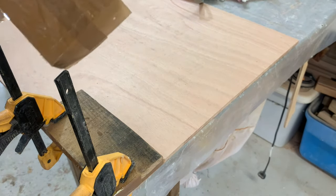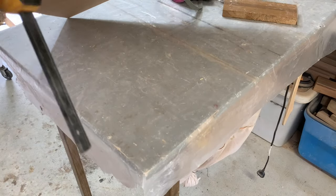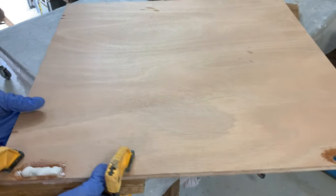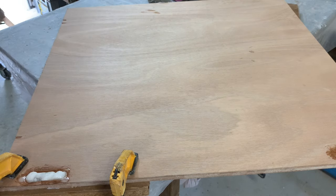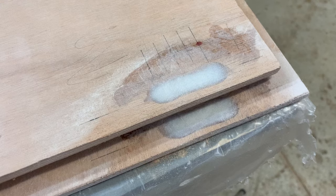surface. These have got that brown packaging tape on. What we'll do is in a minute we'll go back and we'll smear that flat, or leave it slightly proud even, but try just to make sure that we don't have any voids in there and we get that flared section where our tapers are, so they're all good. Right, again we'll repeat that 6 times.